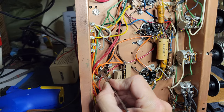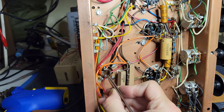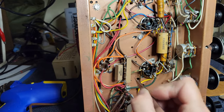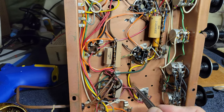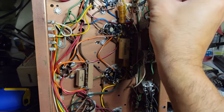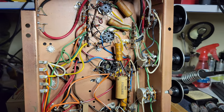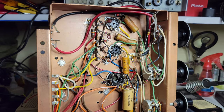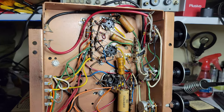The main capacitors in here are not super far out of spec. They're supposed to be 40, 40, 30, 30 — and it's more like 56, 46, 33, and 33. So the 30s aren't too bad, that 40 is not too bad, but the first 40 is pretty bad. That'll still function well enough in the short term, even though that overcapacitance indicates they are leaking. What are really bad are these blocking capacitors — coupling capacitors — this one, this one, this one, and this one. They're all way over the spec capacitance, which means they are likely leaking DC and may cause red plating if I simply turn it on. Those should be replaced straight away.